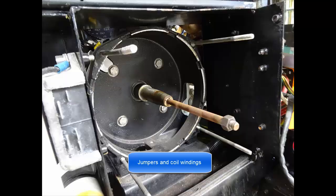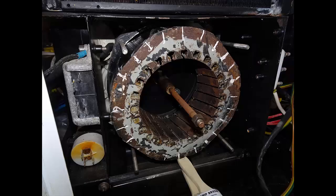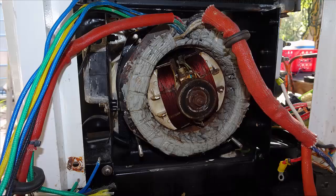size. This series of pictures shows how the stator housing sandwiches in between the engine end plate and the bearing end plate. And we have to have all these wires shown in this picture right here. They have to be contained within those areas, so the thickness of this grouping is very important.